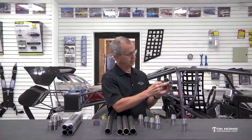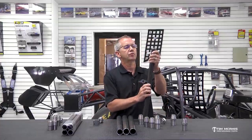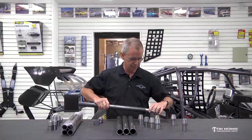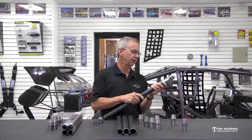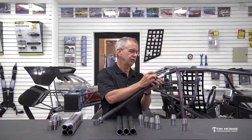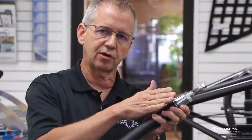Once you lay all that out and get this set up, you can cut your tubes to length — cut it to the exact length of the inside of this B-notch right here. We take these on a belt sander, use the disc side, and spin them by hand to put a little chamfer on the edge so that when this slips together, you've got a little V-groove there to get a nice hot weld in there. On your rosettes, once you weld them and fill them up, you want a slight dome to the top of the rosette — you don't want it sunken in or concave. Same way on the weld here: put enough rod in to have a slight upward dome and not sunken down.